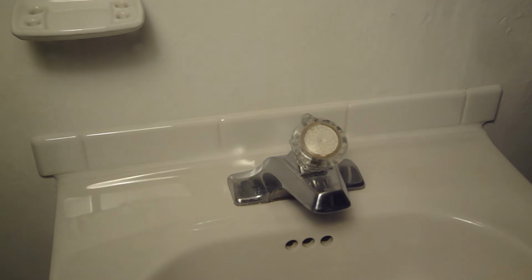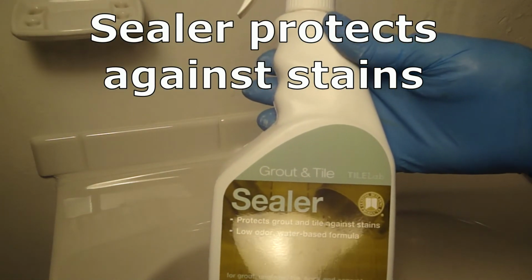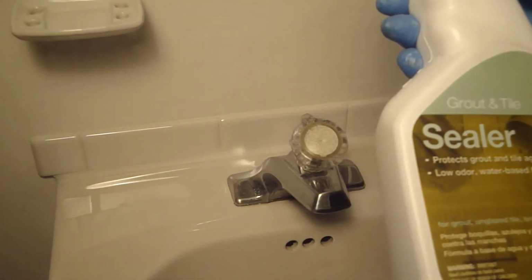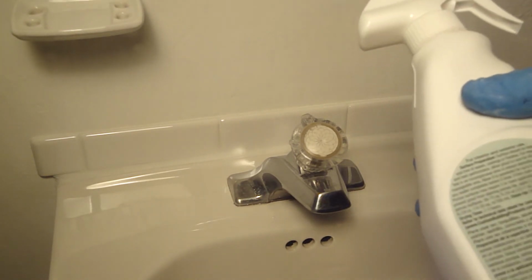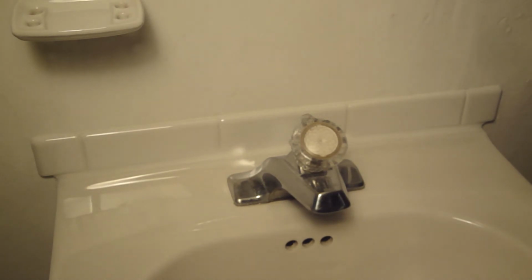It's been 24 hours since I put the grout in, and now it's time to put some sealer on. Using some of this grout and tile sealer from Tile Lab, not a sponsor. Be careful of this stuff. It says it causes reproductive harm. I don't know what that means. Anyway, the deal is you wet the surface of the grout with this stuff and let it sit for 5 minutes, then wipe it off. And then it dries in about 2 hours, and I'll put a second treatment on, and after that, that's going to be it.